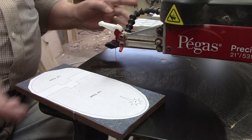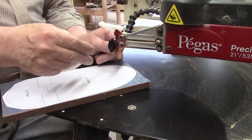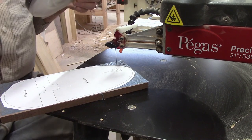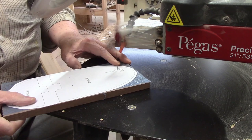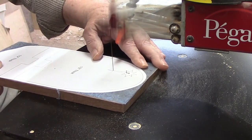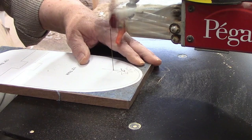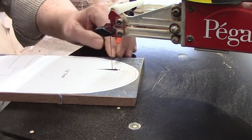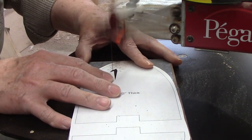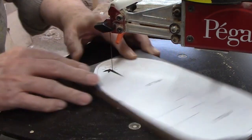I'm going to start cutting with the two pieces that form the back and the base, making the inside cut for the star first. This is half inch thick walnut, and my choice for the blade is a number five Pegas modified geometry blade. I threaded the blade through the pilot hole, tightened the upper blade holder, flipped up the tension lever, and double-checked the bottom blade holder for tightness. I drilled the pilot hole approximately in the middle of the upper part of the star. There are a lot of points on this star and the angles are so acute that the only practical way to cut it is from the center out. I cut from the pilot hole along one line to the point, then backed the blade to the pilot hole and cut down the next side. By making the cuts this way, all the points are sharp rather than rounded.